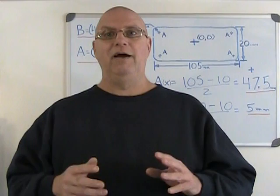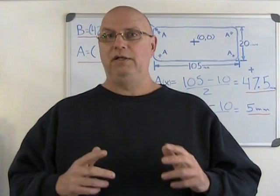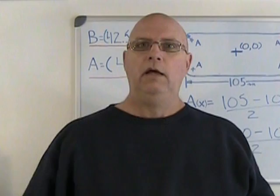And again, if you do that and make a slight mistake, you still have a good chance of being within your tolerance, because that pocket would be good right up to 1 inch 5/1000ths of an inch. So, external, you're shooting for the top end of the tolerance, and internal, you're gunning for the lower end of the tolerance.